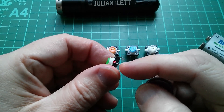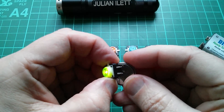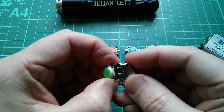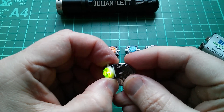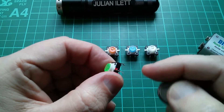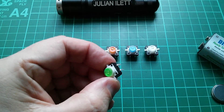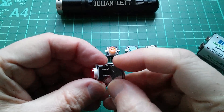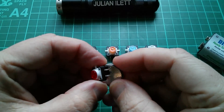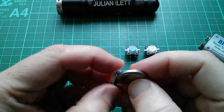Also interestingly, the pin marked red is not the positive — it's actually the negative, the cathode. So red for cathode; maybe that red means the pointy end, the bar end of the LED. So of course red on 3 volts is consequently very bright because it has a lower forward voltage.